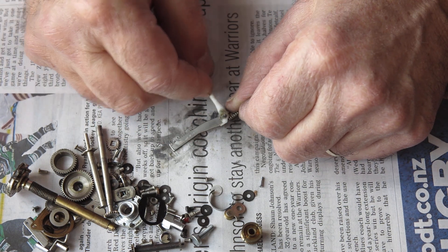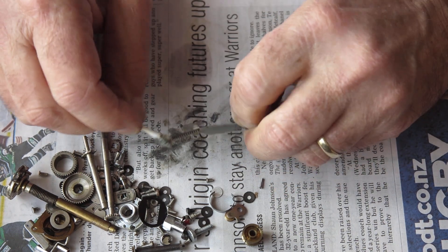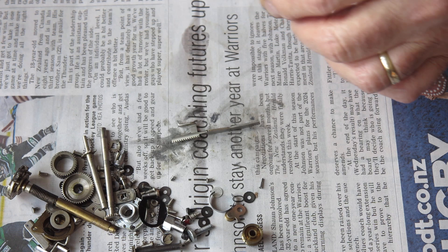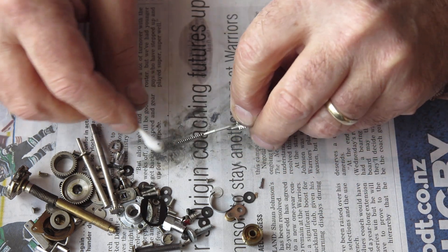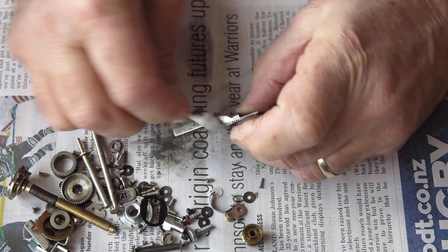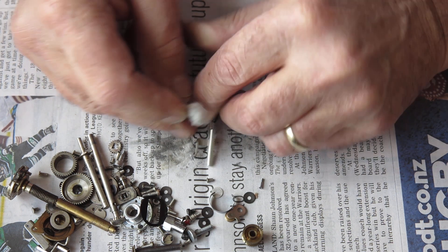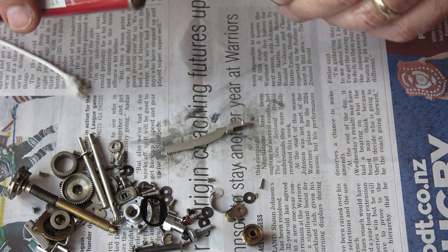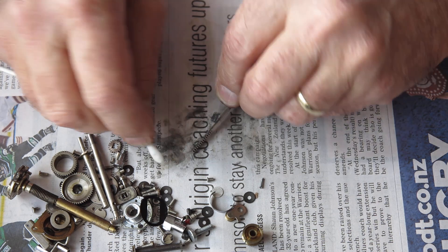This is the shutter cocking rack, and it's quite greasy — there are two different lots of grease here: a yellowy-orange grease and what looks like a bit of graphite grease or something grey. When you see multiple colours of grease on one component, it can only mean that someone, instead of removing and cleaning the part and then lubricating it, has simply added more grease. That might dilute the grinding paste a bit, but it's not good practice. Components need to be cleaned and then lubricated — not just have lubrication added to the mess that's already there.